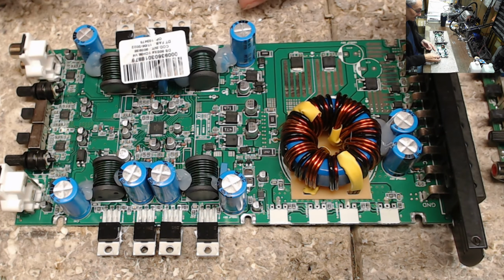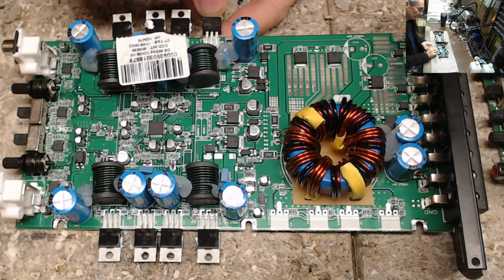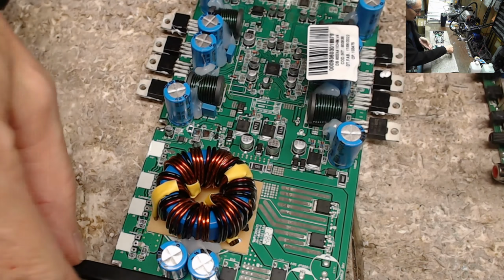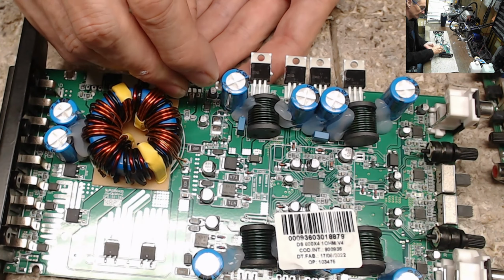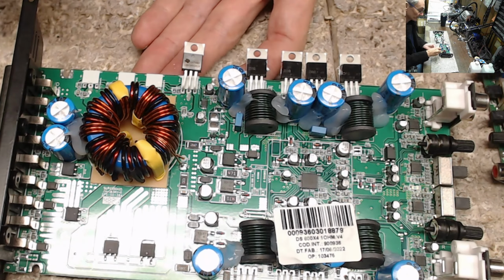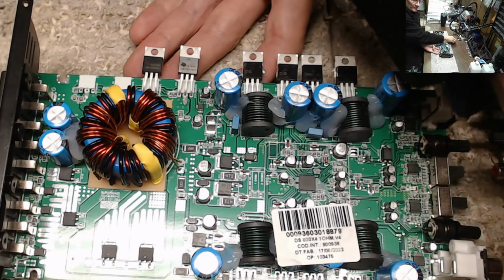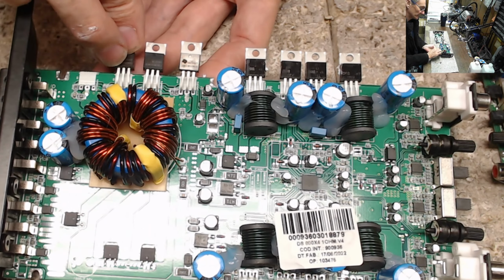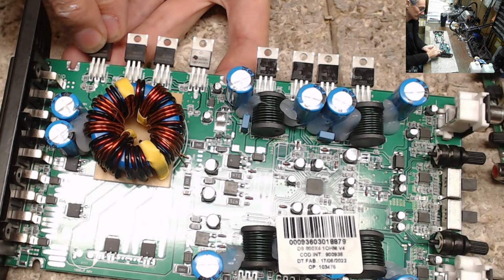I'm just going to go ahead and put in a new 530 in here, the IRF530N for the output section. And I'm going to put the new power supply transistors in. I have kind of my own way of forming the legs of these power supply transistors. Sorry for the reach over the camera there, guys. I make a wide arc of the transistor legs to help reduce any high tension stress points that potentially could break the leg of the transistor while this is in a vehicle.